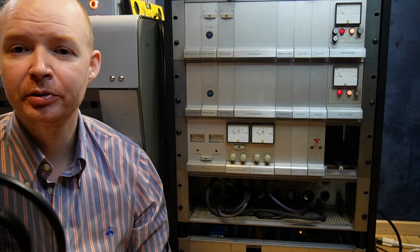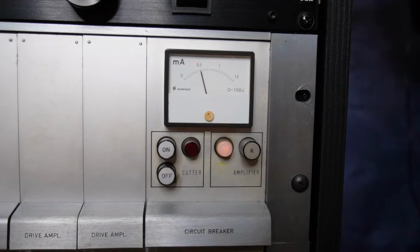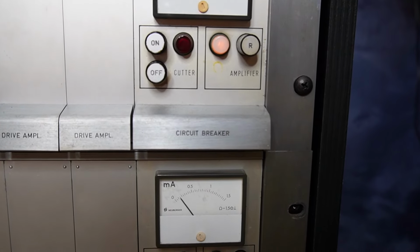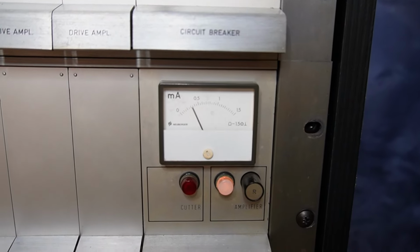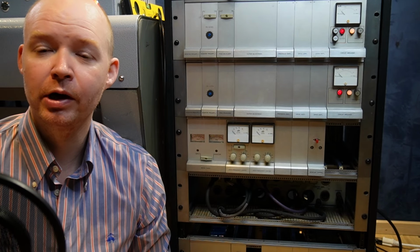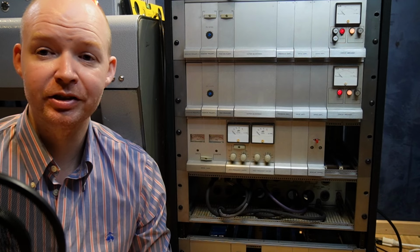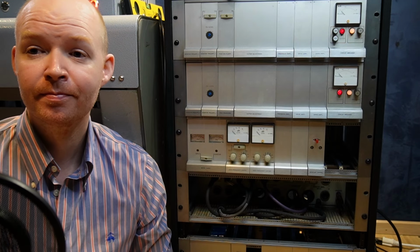The other thing that probably jumps out is the circuit breaker section. This is really important for a working studio because the amplifiers can easily push out way over an amp of power into those tiny coil wires. High frequencies especially take a lot of power to cut, so sometimes you might have an unexpected burst of white noise or a really loud cymbal hit. The circuit breakers can't catch everything, so we still have to be careful, but they do save your bacon.